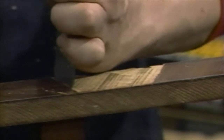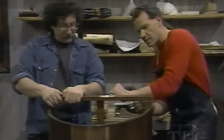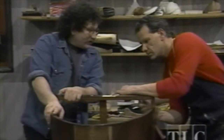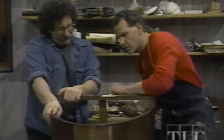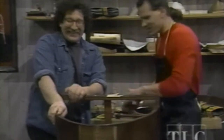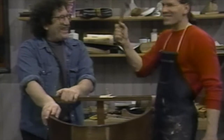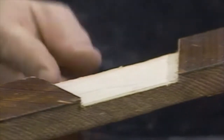You've got to keep scoring and peeling. What I'm doing is I'm actually pulling down on the chisel as I'm banging, so it's cutting. If you don't do that, forget it. They don't make electric chisels — we used to do that with the hammer. We've cut and chiseled this down to the depth of the underlayment.